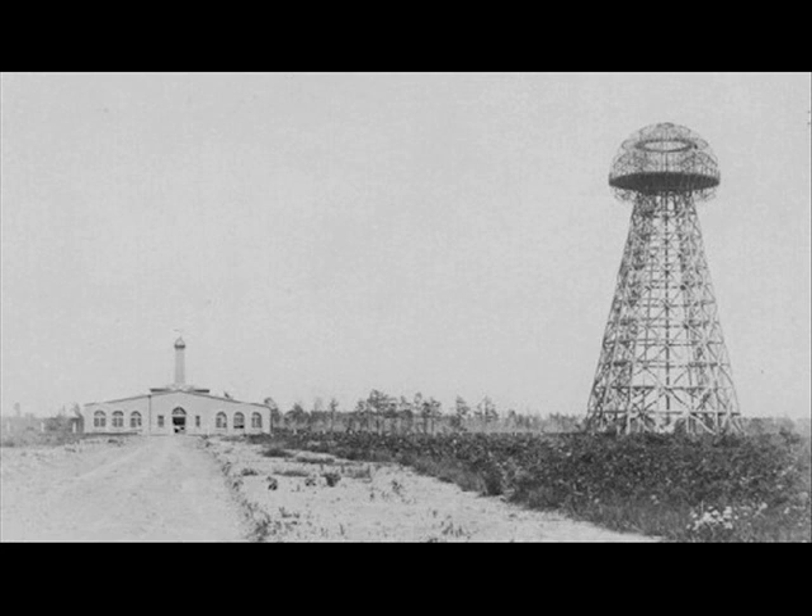Your Tesla coil and its associated spherical capacitance have to bring a ground on this point of the transformer, leaving the earth connection hot. So the thing is capable of transmitting, and then you feed it through a regular radio frequency transformer, either resonant or not, and that delivers or abstracts energy from the system.